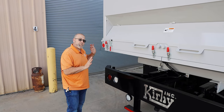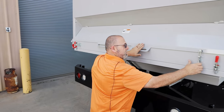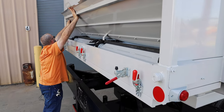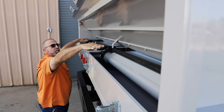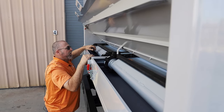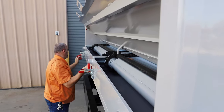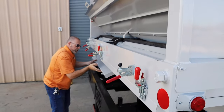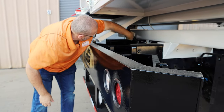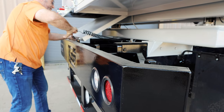Our delivery boxes — we've really simplified the rear end of this thing. We've made these guards on the back simple, quick, and easy to open up. You can get back here, pin it, it's easy to access these chains, check them, see them, grease the bushings here on the back, check your slack. You can open up these guards back here — it also makes it easy for you to clean out that feed that makes it to the back. We have a hose back here so that you can clean any of that feed that makes it back here.